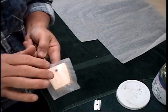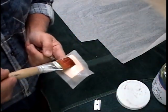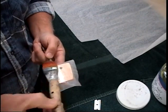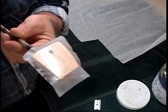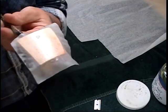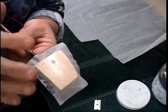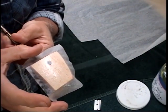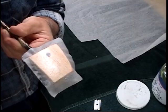I know there's just a little bit of dope less than what would be optimum here. I'll lay a coat on here and let it sit there for an hour. That little bit of retarder — that 20% — is going to just penetrate. When I come back to this in a couple hours, I can just razor it off, and tomorrow I'll be ready to sand. Put a couple more coats on — I can put probably three coats on before I want to sand it. Two to three coats but I can do them two, three hours apart. So actually in one full day like a Saturday or Sunday, I can get a good chunk of the finishing done.